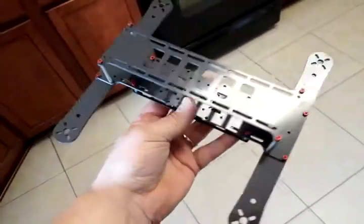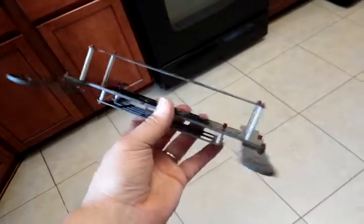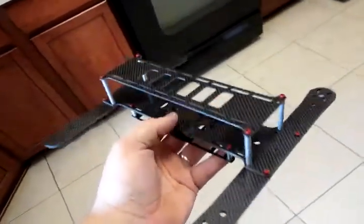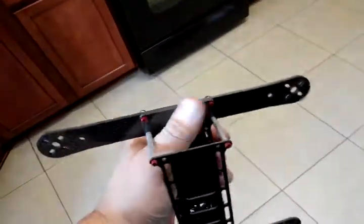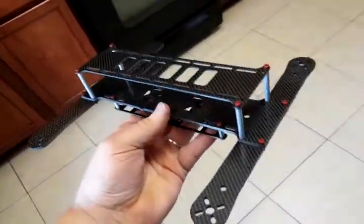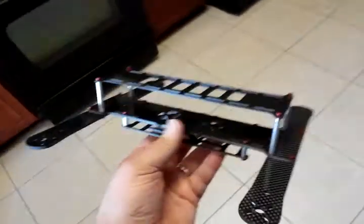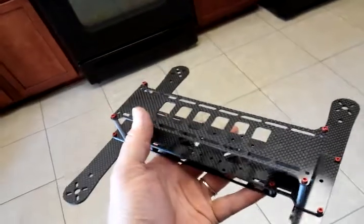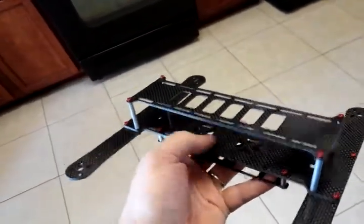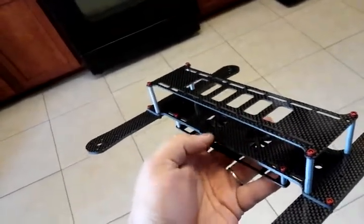I'm going to come out with a 380 or 400 size of this frame. It'll be a little bit different but it's going to have gimbal mounting on the front for a small brushless gimbal — it'll hold a GoPro natively or a Mobius. You can actually fit a GoPro on the current frame too. There's no need for a dirty/clean setup on these little frames — guys doing that are just adding unnecessary weight. With Zeal tape or padded Velcro, I'm not getting any vibration issues in the camera, so adding another plate or 20-30 extra grams of standoffs just isn't needed.